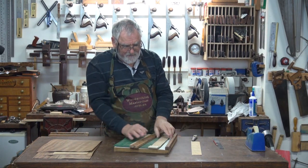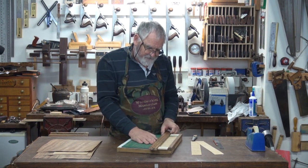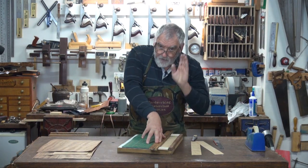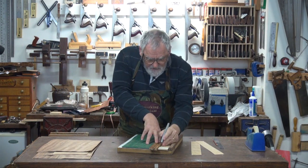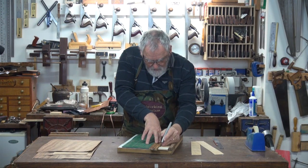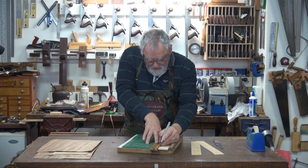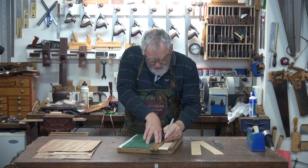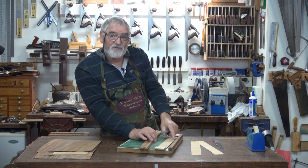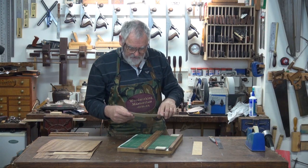It's a question of feel and listening. You can feel when the knife is cutting through the veneer all the way, and you can also hear it — there's a change in the sound that the knife makes. If you've got 64 squares, that's really eight rows of dark and eight rows of light, but you want to do one extra row. It doesn't matter if it's dark or light, just one extra row and you'll see why shortly.